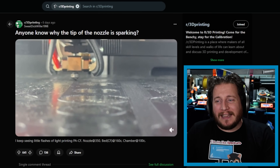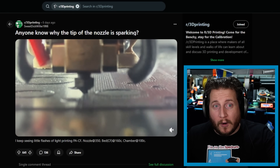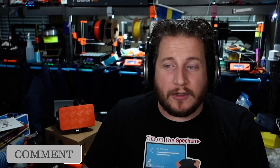Would you guys like to see more high-end machines on the channel? I have a background in running high-end 3D printers — machines that cost hundreds of thousands, if not millions, of dollars. The 22 IDEX is kind of at the top end of the high-end prosumer market and low-end to medium industrial range. We can see temperatures well beyond regular 3D printers: nozzle at 350°C, bed at 160°C, and chamber at 100°C. Even though we technically don't know how to solve this problem, it's unique enough to show you all and see what you think.